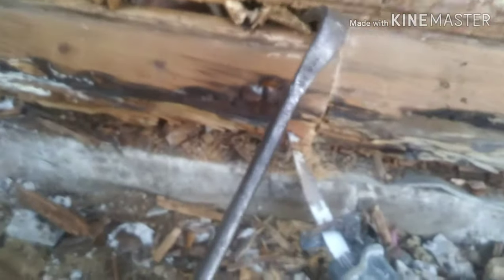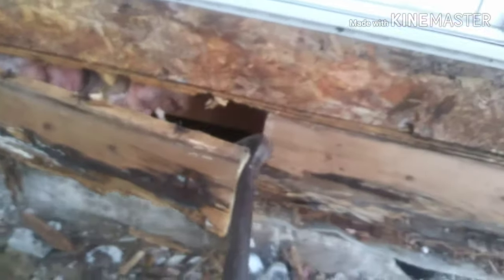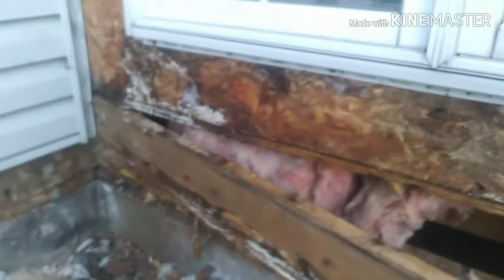I cut next to that block. It's a good idea to go inside and make sure you're clear of wires and stuff like that. I try not to bury the sawzall blade — just barely cutting through the wood. I went in and looked but couldn't really see a whole lot because of the framing; there's some framing in there that's pretty close to the wall.